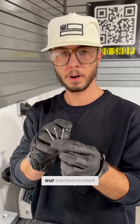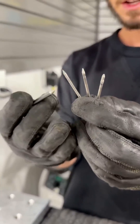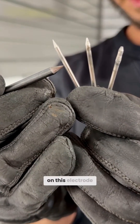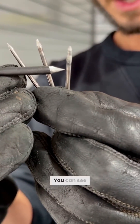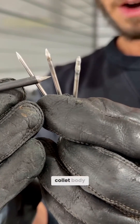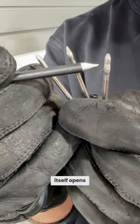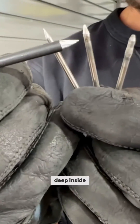How do we remove contaminated tips from our tungsten electrodes? Here we have three various levels of contamination on each of these electrodes. You can see that contamination embeds about down to here on this electrode, and you can see that hazy line right where these electrodes meet the collet body or the gas lens up inside of our torch. When this electrode is hot and expanded, that grain structure of the electrode itself opens up and allows all of this foreign metal to flow throughout the tip and embed itself deep inside the tungsten.